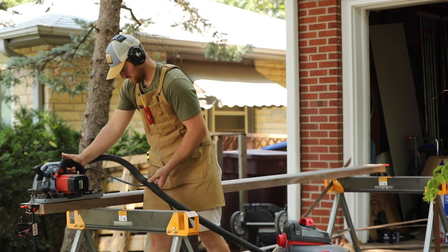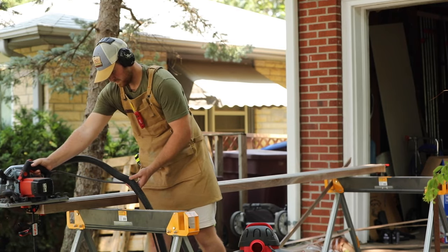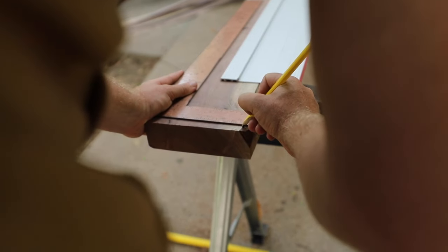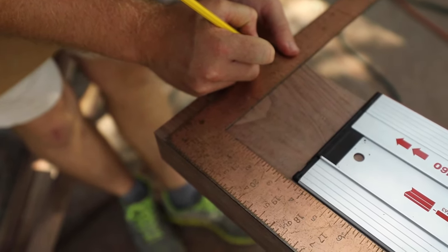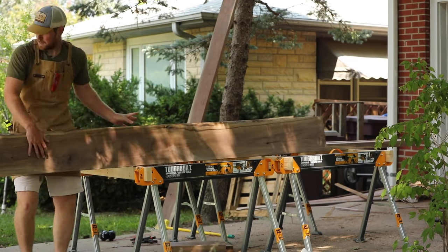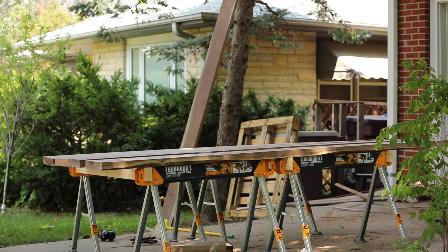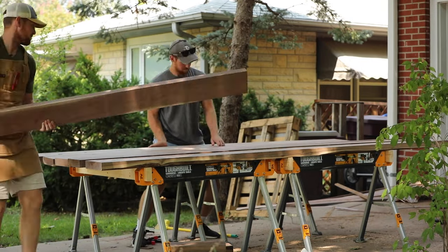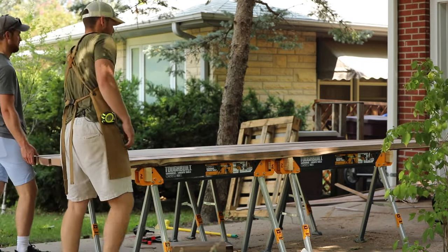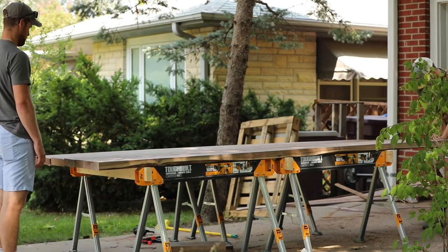As far as wood goes, definitely use kiln-dried wood — it basically takes any chance of there being bugs in it, because bugs will crawl out of your pieces. I was lucky enough to have the help of my brother that day. This table, which I found out over the couple months I worked on it, is definitely on the border of a one-man project. Having him during the cutting and the glue-up stage was much needed.